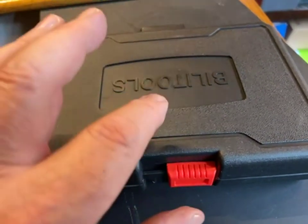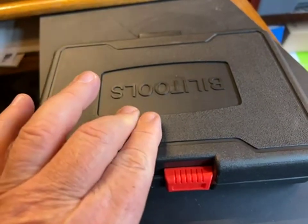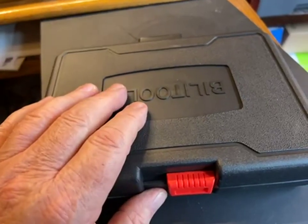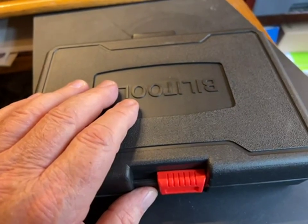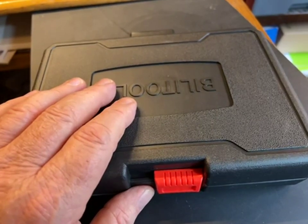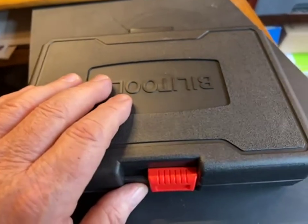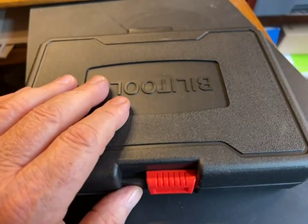Like I said, I would do it step by step: use a rag and brake cleaner first, then use the thread chaser with brake cleaner spraying in there, and then rag them off at the end. Put some lubricant on them and you're good to go. Check your nuts and make sure they're in good shape — they usually are, because if everything's working right, there's nothing running against them. Give it a try, you'll like it. Cheers.